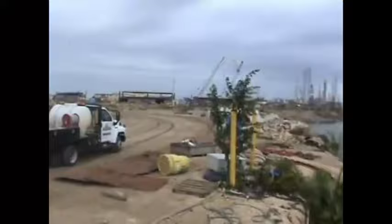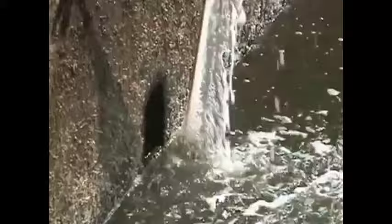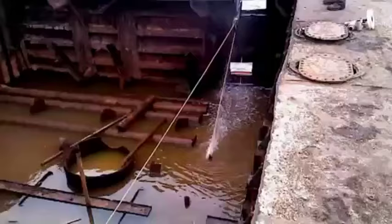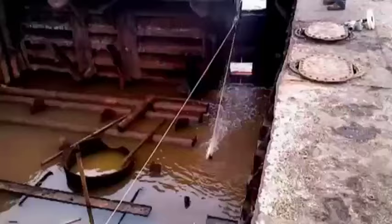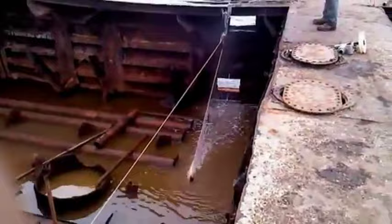Our customers planned on this job to take a week to complete two 40-foot pulls. The first 40 feet of cut took us 13 hours minus setup. The second pull only took 8 hours. As you see, this wire, once it broke through the skirt of this ship, just peeled its way through. This one setup is a very safe and very fast method of sawing.